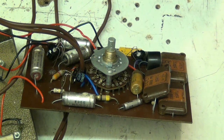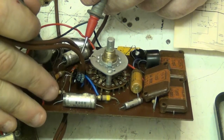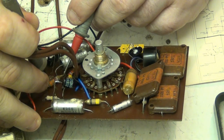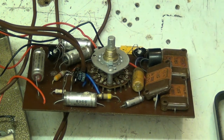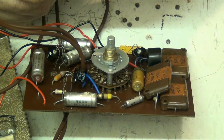I'm checking 3.2, that's R2. Right, well, that reads okay, I'll accept that. I'll just double check it, because that's orange, orange, red. Right. 3.3, oh, it's on the money actually. Yeah, I'll leave that in. That's pretty much on the money, so I'll leave that in. Right. And the next one to that is 100, oh no, I've done 100k. Is R6.